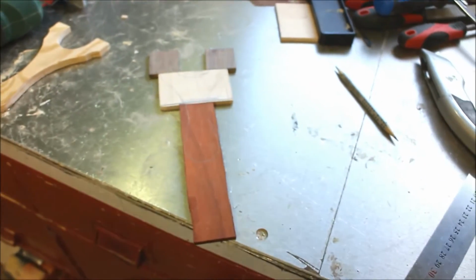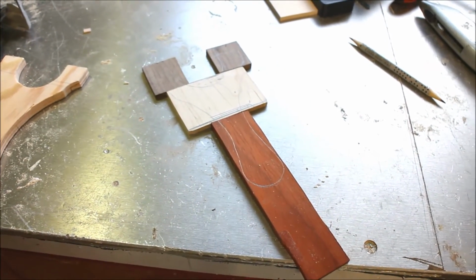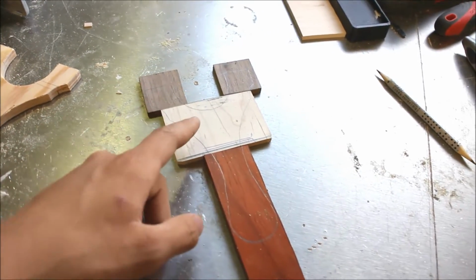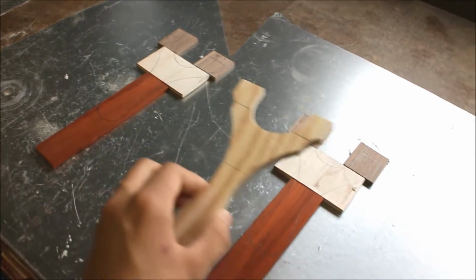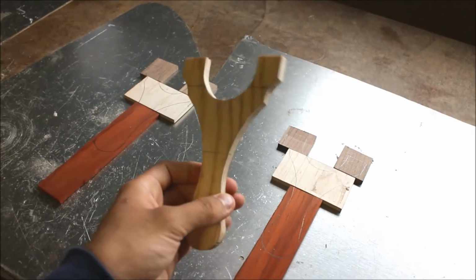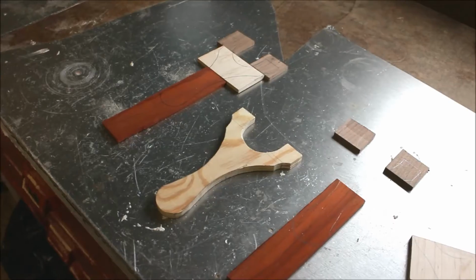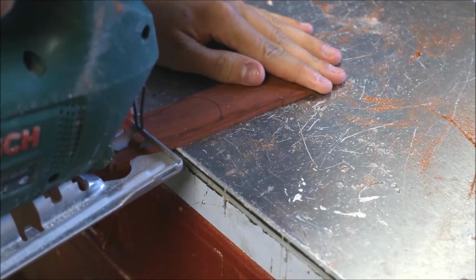We are now going to make the scales, and today I had decided to go the simple route and not make any advanced laminations. We have walnut on top, maple in the middle and then Paduk on the bottom. When tracing on the outline to the different pieces, you have to flip the core, because unless you're using a CNC, your core won't be 100% symmetrical. Once this is done, it is time to cut out all the pieces.